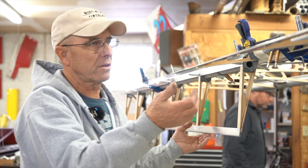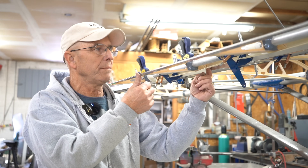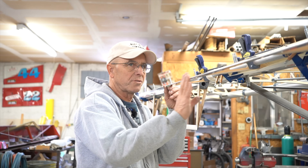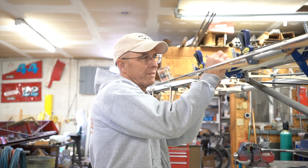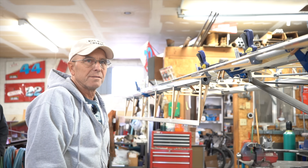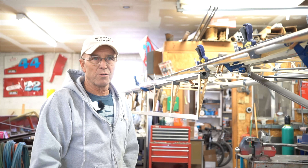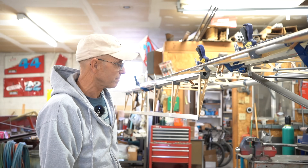With the aileron set, the flap came out really well too. The book calls for an eighth of an inch between the nose of the flap and the back of the wing; I've got a little more than that, maybe three-sixteenths to a quarter, which is fine. I take a stiff one-inch tape measure, measured from the back of my trailing edges to the front spar, and when you turn the tape edgewise you can see right where it is on the spar even though it's a big round thing. That all came out just nice and even all the way down both wings. Some people with more limited shop space can't have both wings on at once — you can still do it, you just have to keep better notes on your measurements to make them alike.